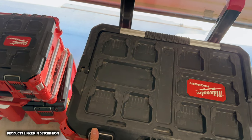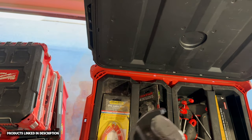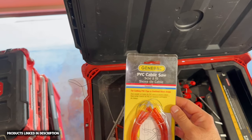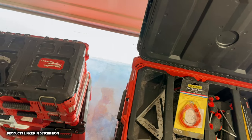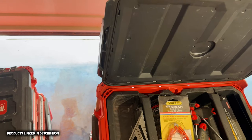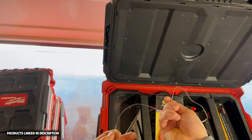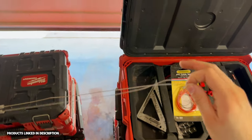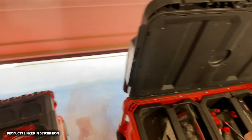In this next compartment, I have this tool I use to cut PVC. This one is made by General — it's a PVC cable saw. When you're working with existing PVC and you can't cut it at a certain angle, or there are wires already inside and you're trying to shorten it, you use this little steel rope — put it on the PVC and rock it back and forth and it cuts right through. I've lost these a couple of times underground, so I keep an extra one on backup.